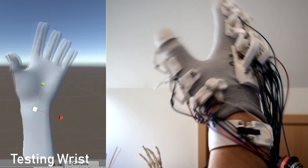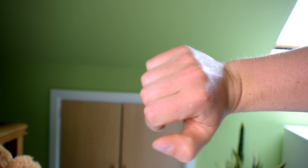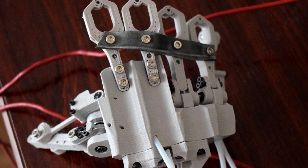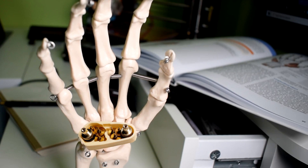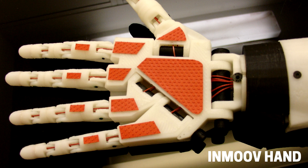With that in mind, I'm thinking of making some kind of gearbox to sit in the carpal section of the hand below the metacarpals, to directly drive the fourth and fifth metacarpals. Where previously I mechanically linked them with nylon, I want a more reliable connection. I'm thinking of having them connected in the gearbox with a reduction ratio so the ring finger metacarpal only moves half or a third as much as the little finger metacarpal, though combining the two axes — as most bionic hands do — would make my life a lot easier.